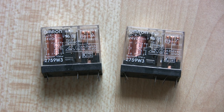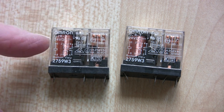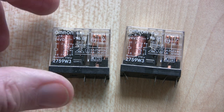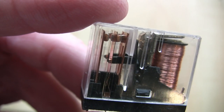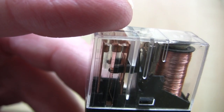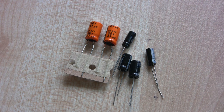These are the two relays as supplied - they are PCB connections as you'd expect and they do claim to be OMRON. Whether these are genuine I don't know, but looking inside the contacts do look nice and beefy. As the whole kit costs 11.5 New Zealand dollars it's pretty good value for money. The capacitors are nothing special although they do say they're 105 degree Celsius, which is pretty good, though these won't be subjected to any significant heat - very little above ambient - so I think they will be fine.